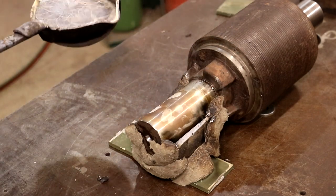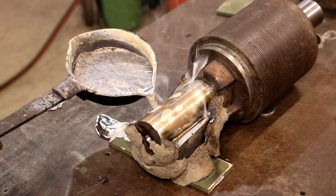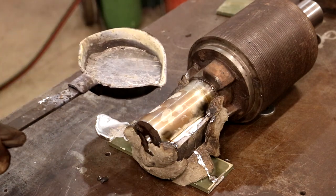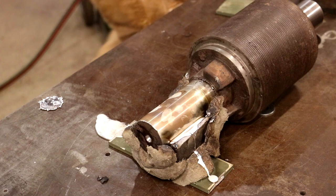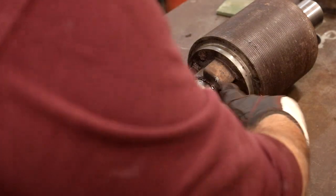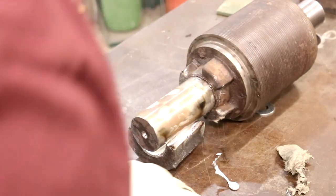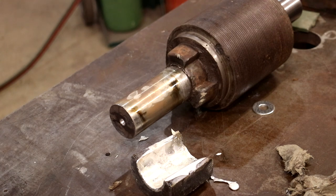Let's put a little preheat in here — you don't want the metal to be too cold or it will cause the babbitt to cool too fast. Getting the shell and shaft up to a couple hundred degrees really helps the whole pour. The Deacon mold material will burn a little bit but it's pretty much fire retardant, so no worries there. This is the same babbitt we melted out — we just pour it right in. It looks good; I spilled a little bit, no problem, I'll pick it back up and put it back in the ladle to re-melt. One bearing down, same process for most of the others.